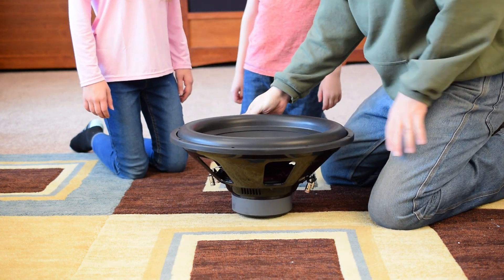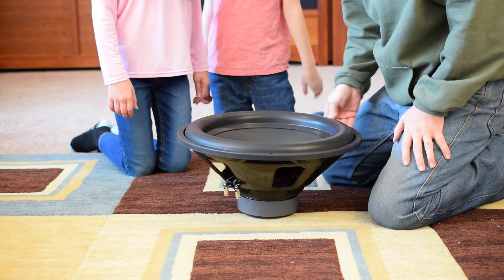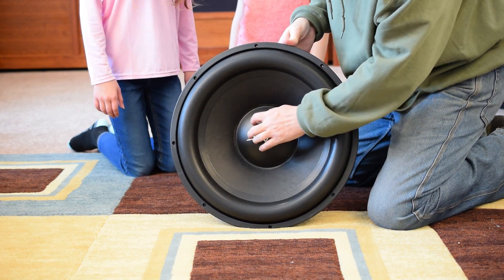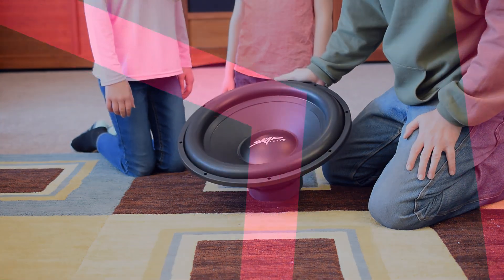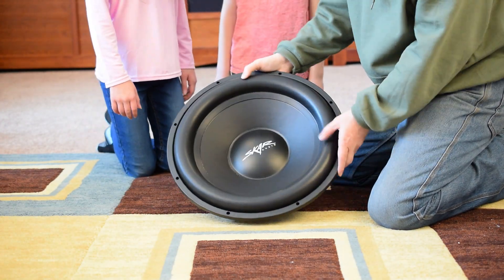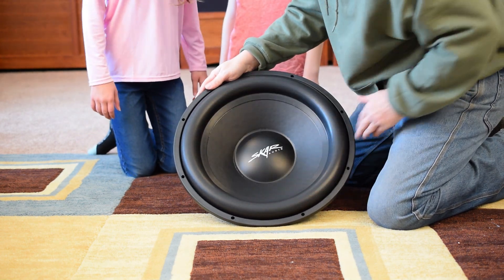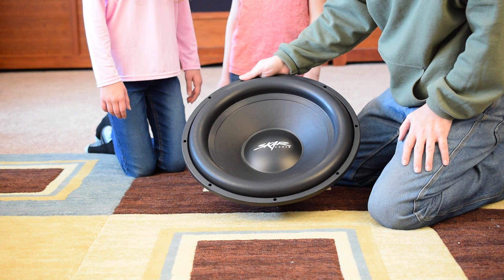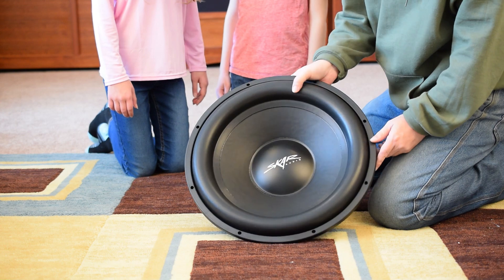Of course we love to see a fiberglass-reinforced cone, a Kevlar-impregnated paper cone, maybe even an aluminum cone — sometimes even carbon fiber on the cone or the dust cap. This dust cap? Plastic. That's number two. Third thing: foam surround. It's got this big foam surround. Foam surrounds are bound to eventually degrade and break down, especially in very hot or very cold environments like you get in a car. I would much prefer to see rubber.